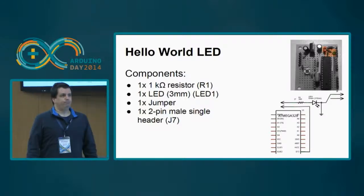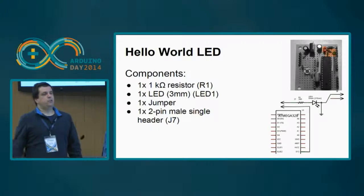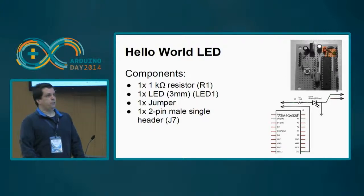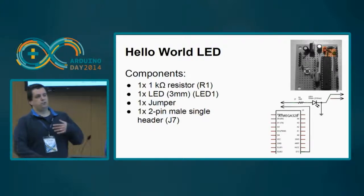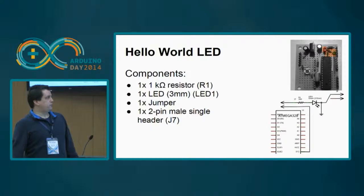In some systems, if you need pin 13, you should disconnect the LED because the LED might interfere with the circuit. And if you want to make it an input pin, or an output pin, you should remove the jumper. So I put an extra jumper there.